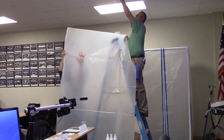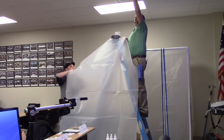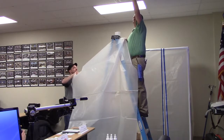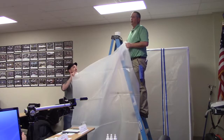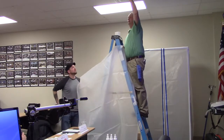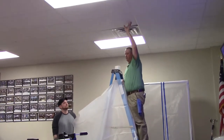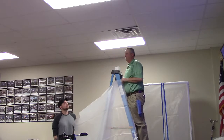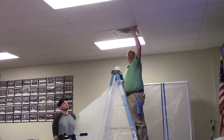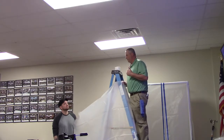Now I'm going to take my containment around this grid, splice it, and come around this grid here. You want to check before we start and see how easily the tiles pop up, and then once we move them up, we're going to drop them right back down. If we're on a project where the tiles are in place, these tiles will work well for a containment lid — as long as they're not stained, contaminated, discolored, or have pieces missing, and we want them to lay flat to the grid. Sometimes we can just cut along, pop the grid, and it will drop back down.